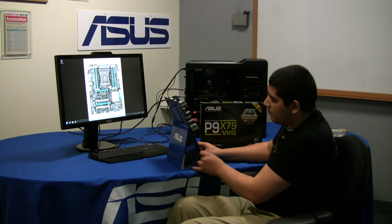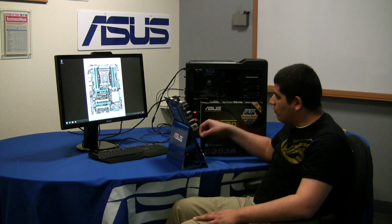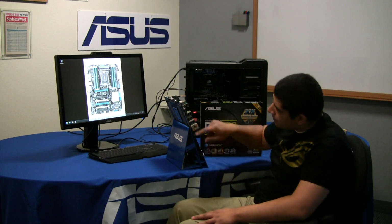Now in the event that you potentially overclock the system too hard, or maybe there's a surge or spike or sag, sometimes you can get occurrences that can corrupt the actual EEPROM, the firmware chip. If that were to occur, you can also attempt to utilize the same mechanism to overwrite the firmware, get it updated, and get back up and running, saving you from having to RMA the board or remove our replaceable ROM chip and ship it back for replacement.